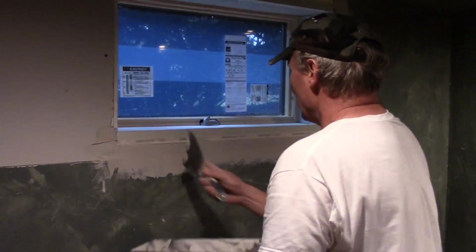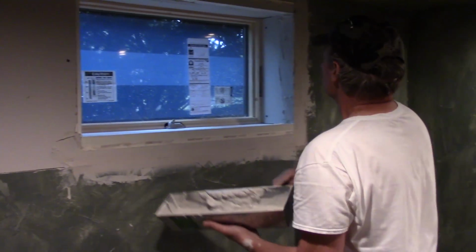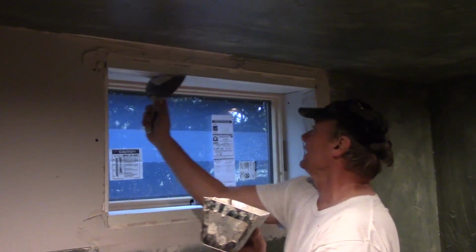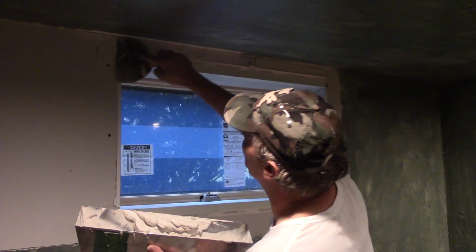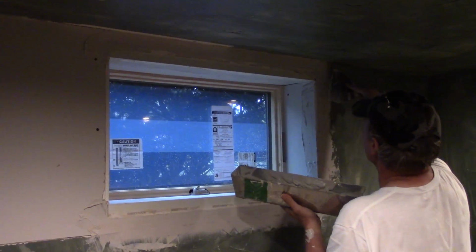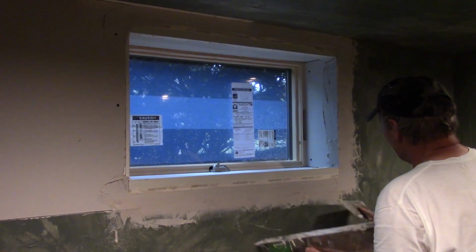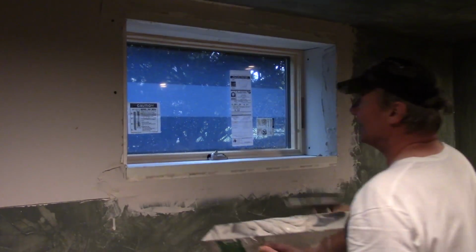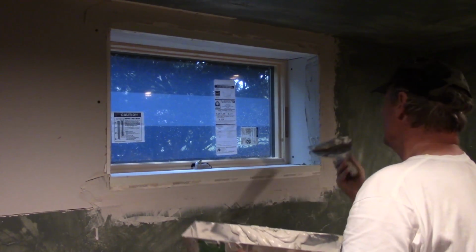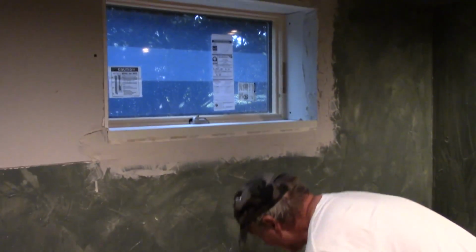The thing about it is it was a brand new home. The drywallers never pre-filled anything. They weren't even done trimming it, doing the final trim yet. And there were settlement cracks all over the house. Above the doors had cracked. It just had a lot of cracking in it. And I told them, you do not want to put knockdown on this house.